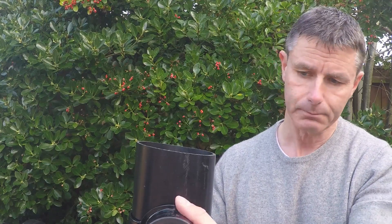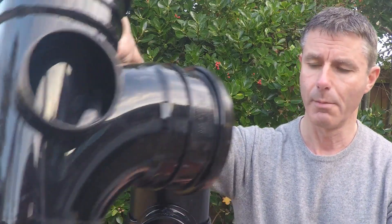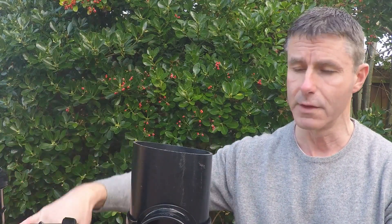Just be aware there's a top and a bottom on these because there's a two-and-a-half degree fall, to make sure you've got a little slope for your waste pipe coming in. So those are the three ways of connecting a waste pipe into a soil pipe, all with a BOSS adapter — using either a strapped BOSS, a BOSS on an existing fitting, or a new BOSS pipe.